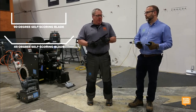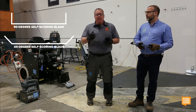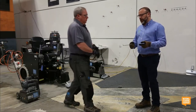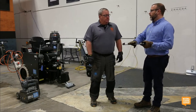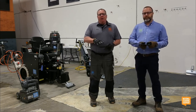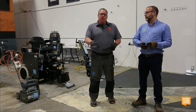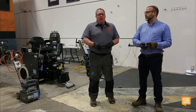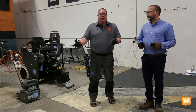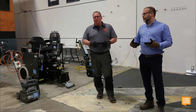We're going to talk about carpet on concrete on the first floor and carpet on the second floor. What other coatings might you use a self-scoring blade on? Anything monolithic — such as vinyl that's rolled out. My last house in Oklahoma was a slab on grade and it had tons of vinyl. We used self-scoring blades to take it up because you don't want to remove an entire kitchen's worth of vinyl at once; self-scoring it and cutting it into strips is much more efficient.